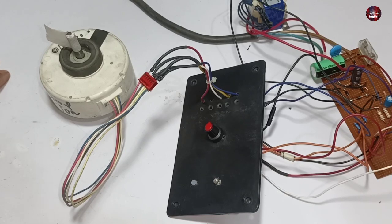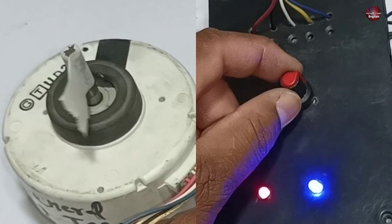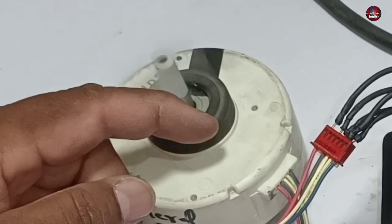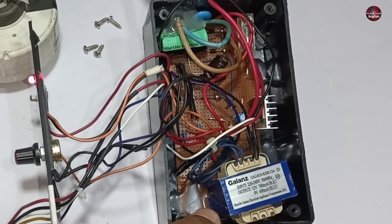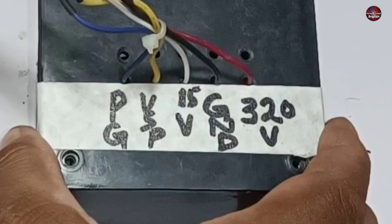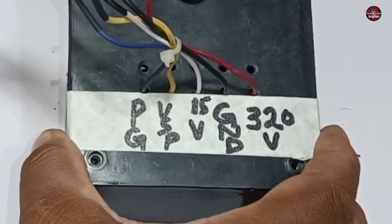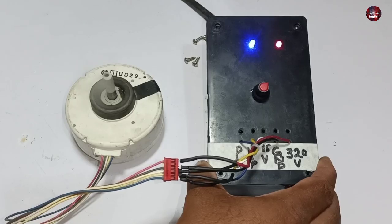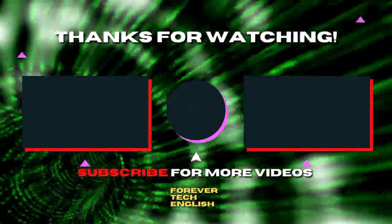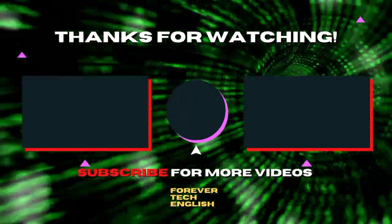Now I am going to test the motor. The wire colors of the motor and the connector are the same — insert the wires into their matching color, and our connections are ready. Now let's pass electricity through it. And you can see the motor is turned on. Now by rotating the knob of the potentiometer, we can control the speed of the motor. I have fixed the circuit inside a box and will now cover it with the lid. As you can see, I named the controller wires: 320 volts, ground, 15 volts, VSP, and PG or feedback. So I hope you will make one for yourself at home through this tutorial. Click on the left or right thumbnail on the screen to watch our next videos, and subscribe — it's free. Thank you.